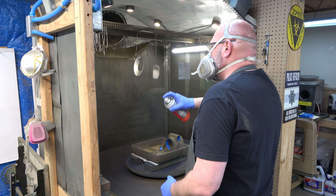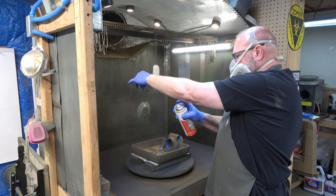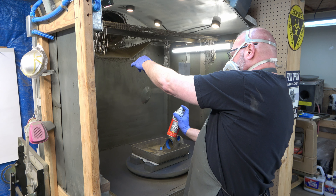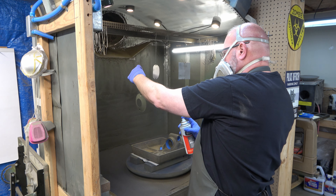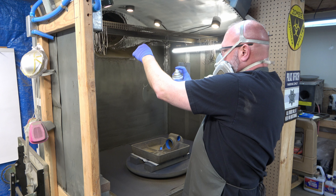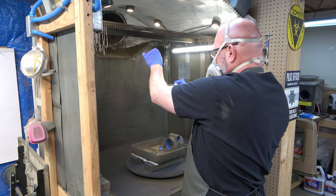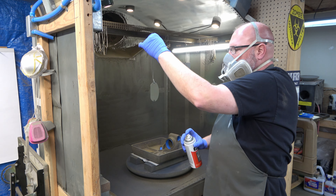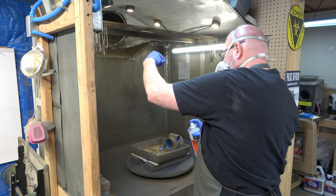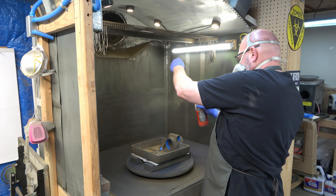So this is that metal etching primer. I've got a couple of pieces hanging there from the motor — that's the air cone and the capacitor cover, the switch guard, and the terminal cover. I almost always paint that stuff first. That way, if anything's messed up with the paint — if it comes out splotchy or there's any debris left on the items — I can strip it off of those small parts and get that squared away easier than I could on one of the big pieces of cast iron.